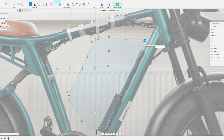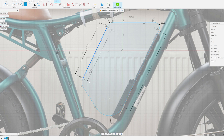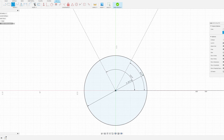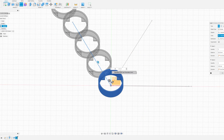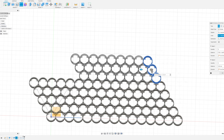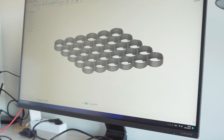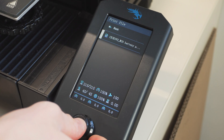I then create the battery holder for the lithium-ion battery cells in a compact design to fit the frame. I will be 3D printing the holders on my Ender 3 V2, splitting the bracket that will hold the battery cells into 3 parts to fit my printer. Once the 3D model is complete, I load it into the slicer software to create G-code for the printer to read. After loading up the orange PLA filament, the printing of the battery frame sections can begin.